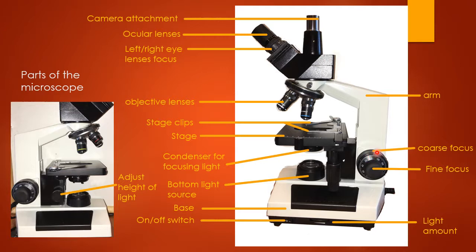If you turn these grips here, that's the coarse focus, and what you'll see is the stage move up and down. When you focus — and I'll go over this more later — you want to start with the coarse focus on a low power setting, and then use the fine focus, which is this smoother knob on the outside. The rough lined knob is the coarse focus and the smooth outer knob is your fine focus.